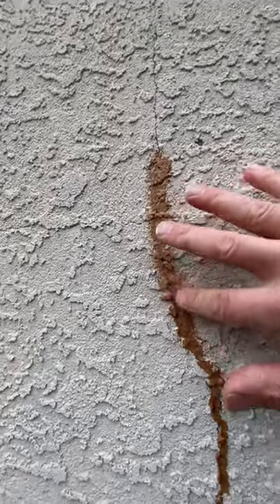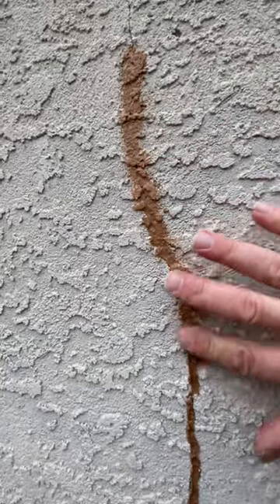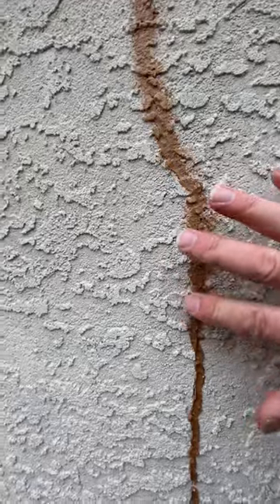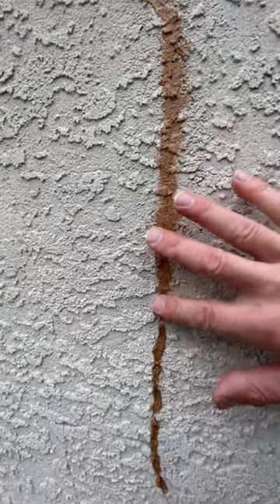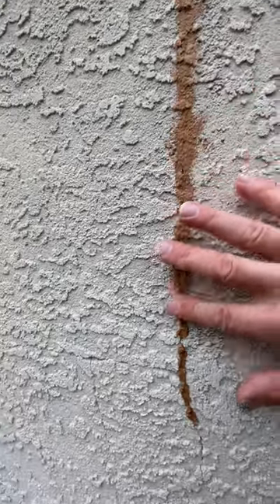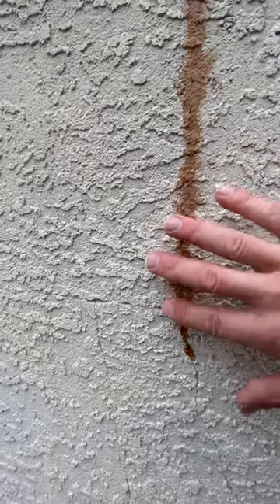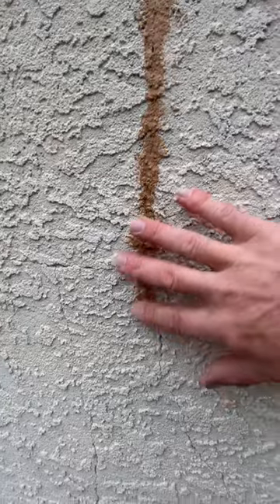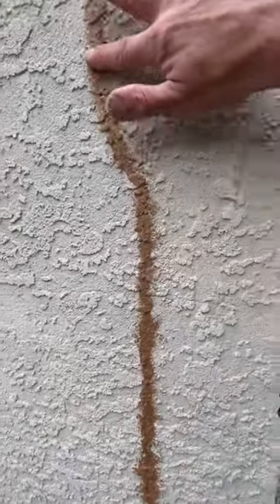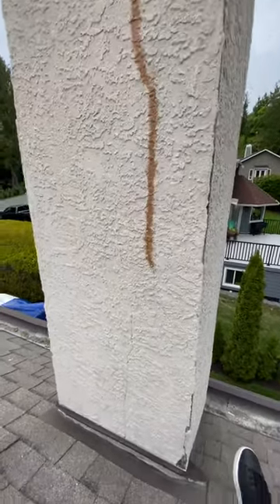The elastomeric paint will work, don't get me wrong, but this just fills a little bit more gaps. Elastomeric coatings don't always fill big gaps — they do bridge hairline cracks. If you were to do this with your bare hand all day, you'd probably have no fingertips. Anyway, I caulk it up, let it dry, and then I paint it.